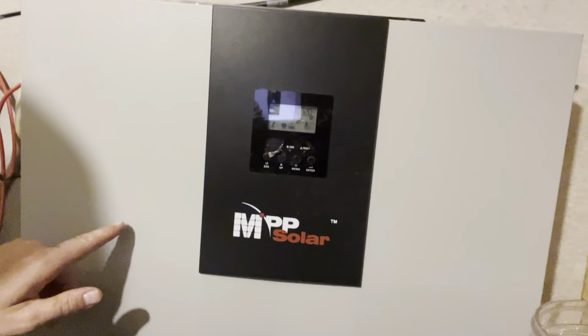The other thing you have to account for is this inverter is not the most efficient. They don't actually state it, but I've seen some things online, somewhere between 60 and 70 watts of consumption just running the inverter, just sitting there idle. So you now take 70 watts plus 100 watts and I have, you know, less than 2 days worth of power in one of those batteries in that circumstance.